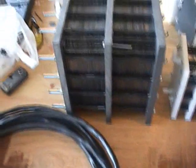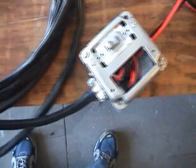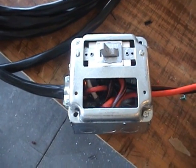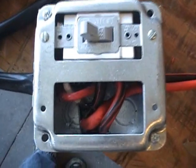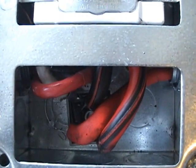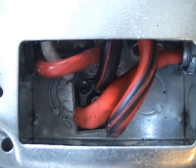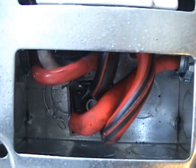I wanted to show everyone the electrical system I'll have hooked up to this. What we've got here is I've got 8 gauge wire coming into this box. At the bottom of this box I have a bridge rectifier. What the bridge rectifier allows me to do is to take AC current and change it back to DC current, so that we can run the hydrogen generator.